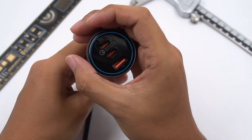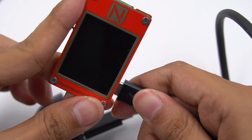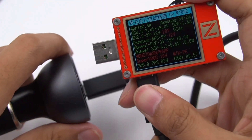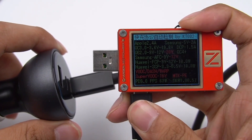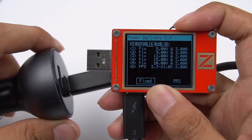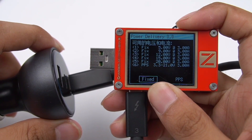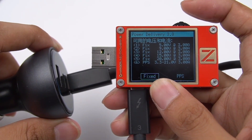There is a circle of blue LED light around the edge of the front. Using the ChargerLab power tester ZKT002 to test USB-C1, we can see it supports Apple 2.4A, QC2, QC3, AFC, FCP, SCP, and PD3 PPS protocols. It has five fixed PDOs: 5V 3A, 9V 3A, 12V 3A, 15V 3A, and 20V 5A, plus one PPS PDO of 3.3–21V at 5A.